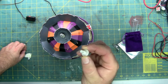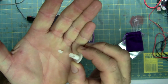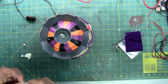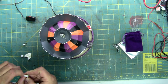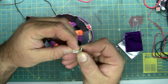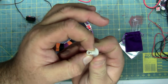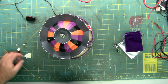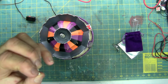Here's the interesting one. There's the broken piece. Focus. There you go. Which attaches there. This is a very unique gear. Honestly, it's the first time I've seen this gear on any Lemax product. But when it's put in, like so, it has a little notch. So it's got a keyway or a cam. I'm trying to hold it better, which drives some moving mechanism inside. And also what's surprising is this uses mostly just fine teeth gears. They're not very thick on the tooth.